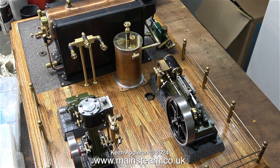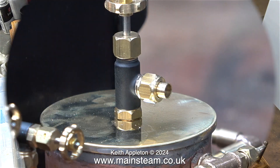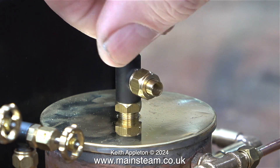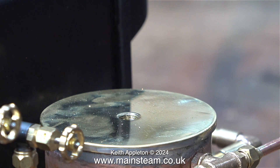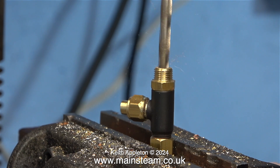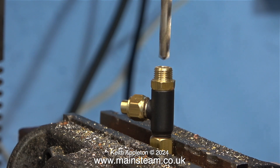This clip was recorded before I started the piping and the plant looks quite different now. I need to make the condensate drain. It's not sufficient to just stick a tap on top of the tank — that would not drain it. I need to solder a piece of copper pipe that goes right to the bottom, or almost to the bottom, of the tank.